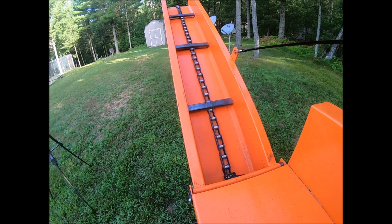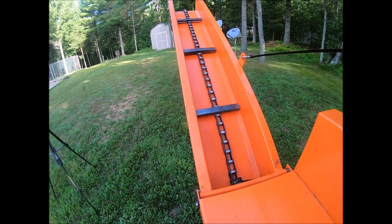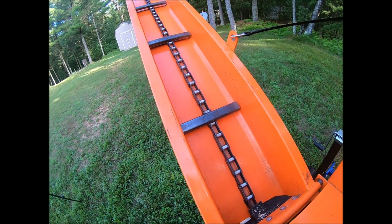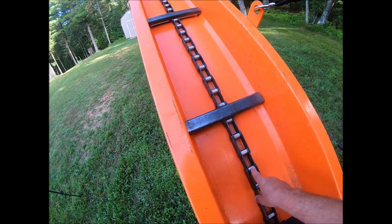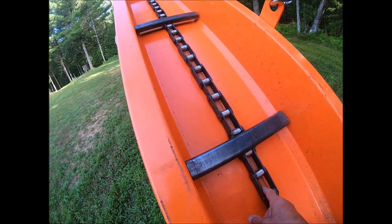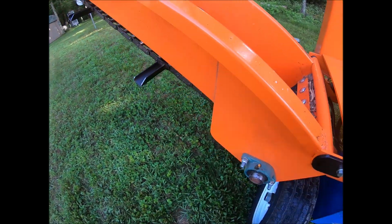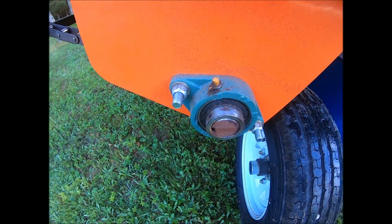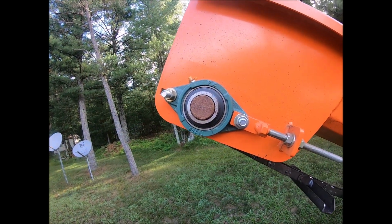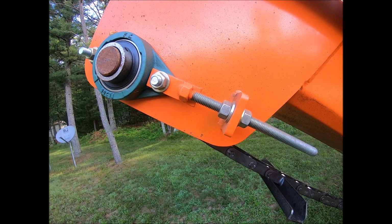I don't know another manufacturer that attaches a conveyor onto their splitter. I think Eastonmade is one of the only ones. And on this one, it utilizes the 81X chain. This bar below is easy to grease, or should I say, just put some oil on it, and that's all the lubrication it needs. It does come with pillow blocks, both at the bottom and the top on both sides. Easy adjustment right here. So far this year, I have not had to adjust it at all.